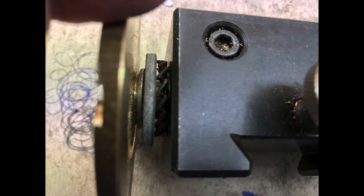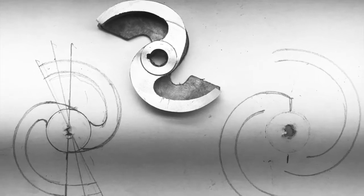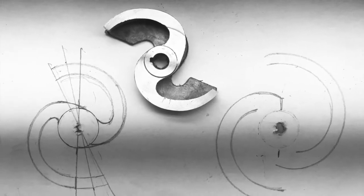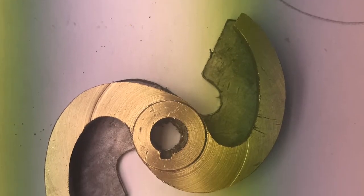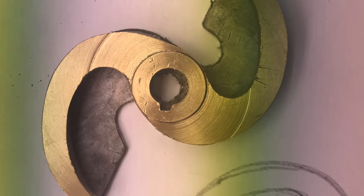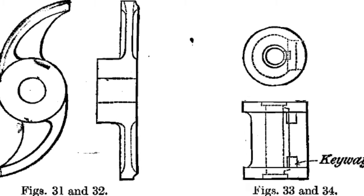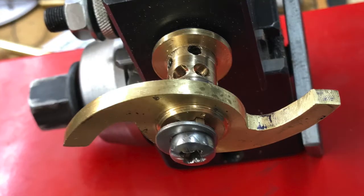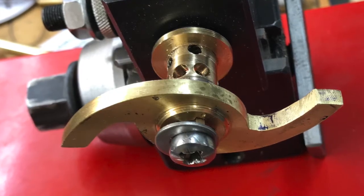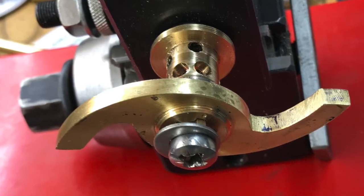On the other end of the shaft I had the brass disc that I had made, and in the chuck I had a milling tool — an end mill — that would cut the shape. As I gradually cut into the brass I would rotate the shaft with a lever, and I found I could just allow it to follow the cam by applying enough pressure to encourage it to rotate while cutting. That worked reasonably well. After I made the first cam I discovered it was the wrong shape, so I decided to redesign it and start again. Once I made a correct one, I used it as a pattern rather than the aluminium one, which I found too flimsy — if I put too much pressure on it, it actually buckled.